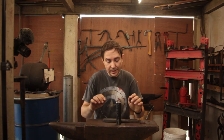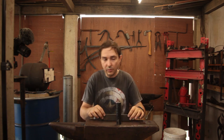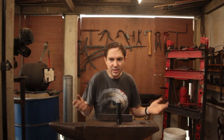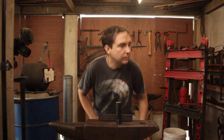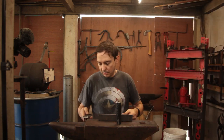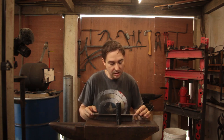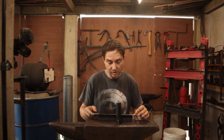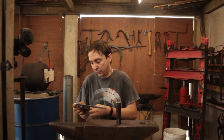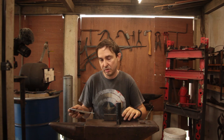So, today we're going to get a start on making the body of the axe that we're making the Damascus steel for. So I've got this piece of mild steel. My steel rule seems to have disappeared again. Which is 230 millimeters long, or 9 inches. It's a piece of 40 by 12, which is 1.5 inches by 1/2 inch.